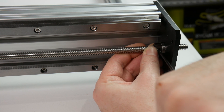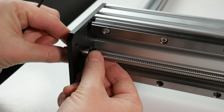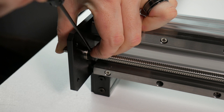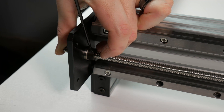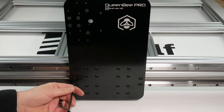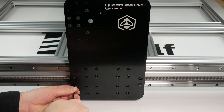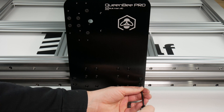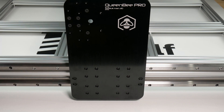Now you can move to the inside locking collar. This collar is just to retain the bearing, so it doesn't need to be pressed too tight. Repeat the same steps for the back of the machine. Now tighten down the screws going to your nut blocks. A common mistake here is trying to apply pressure to nut blocks when tightening these — this is not necessary to remove backlash. Confirm that there is no play in the axis and then move to the back of the machine.